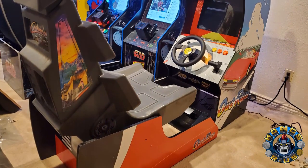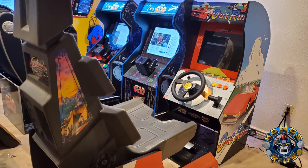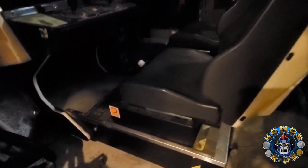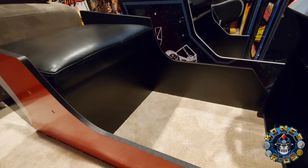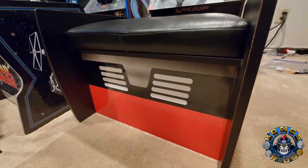After my initial review, I knew immediately I wanted to mod it and started by putting the Cruisin' World seat on the stock bench. But you can see from the placement that it was still sitting too high. Luckily, I'm the proud owner of a full-size Virtua On cab and was able to measure where the standard racing-type seat would usually sit from the bottom — around 11 to 12 inches. However, the stock bench was already 13 inches high, and if I added the bucket seat, it'd be around 17 inches. So I decided to mod the bench.